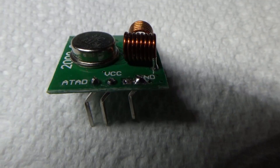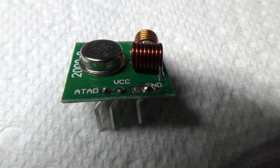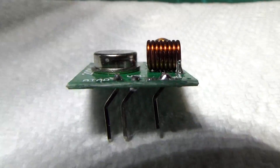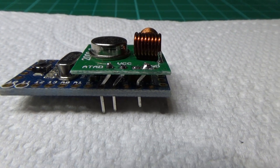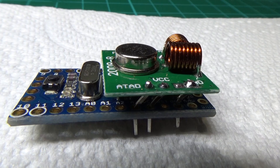As you can see, I've connected the ground, VCC, and the data and just put them on bent pins like that. The reason I bent them is to get it away from the crystal, and it's going to sit on the top.